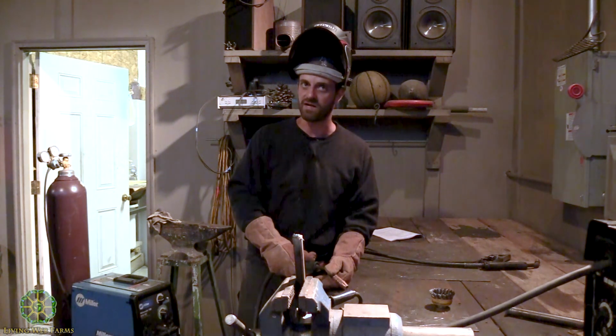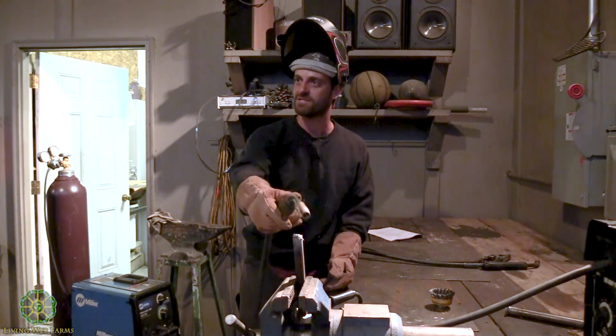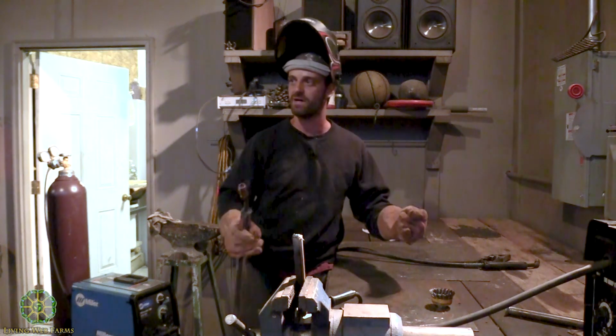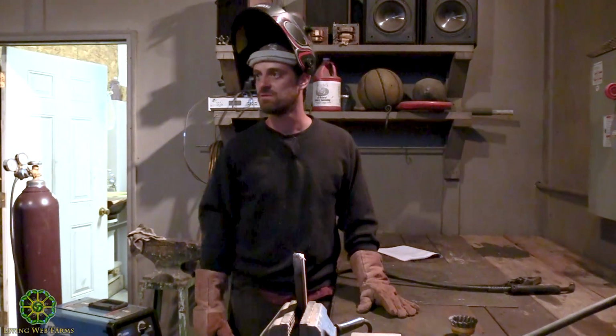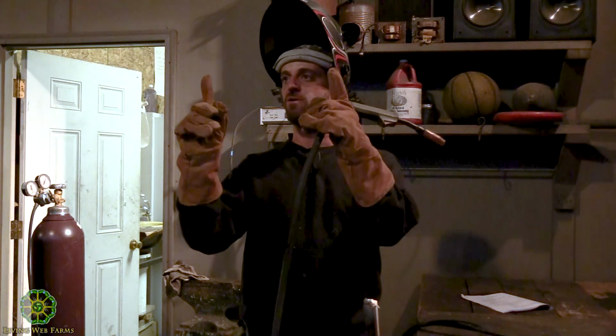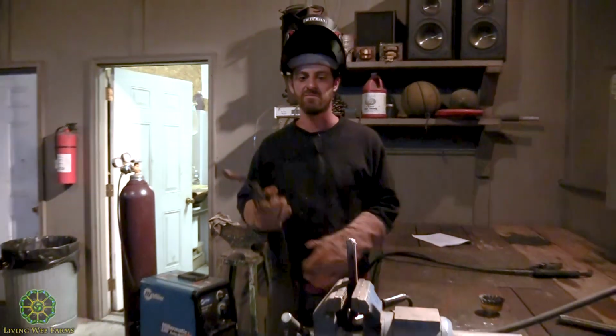And you'll just know it with practice. You'll know when you get the puddle. You'll hear it. It won't be like that just was. It'll be a steady hum. You'll get it, and then you'll feel it, and you'll know when you lose it. A lot of times you just need to start over. Cool it off. You don't have to let it cool all the way, but stop, clean it, start over. I might get the puddle for 8 inches, and then I'll lose it. Maybe my nerves get to me, or a lot of times it'll get so hot that it'll burn through what I'm welding. You'll start to get little holes. That happens a lot when you're doing 1/8 inch type stuff with the kind of things that we do here.